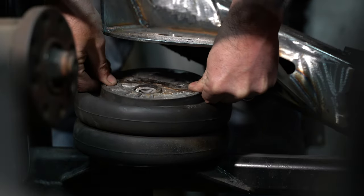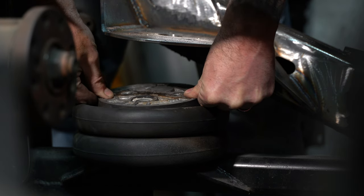Since my bag mounts are 3 inches too far apart, there is 3 inches of bag movement that will never be used. The frame is laying on the ground — it can't get any lower unless you want to start digging. So you've got to subtract that 3 inches from the bag's total lift of 9 inches. This truck can only lift off the ground 6 inches. Now that I'm saying this out loud, I'm realizing I should have just left it alone — my wife never would have known. But I already cut the bag mount off, so I guess I'm making bag mounts.